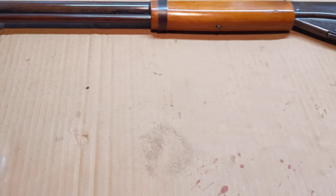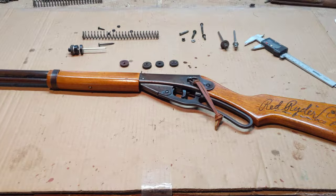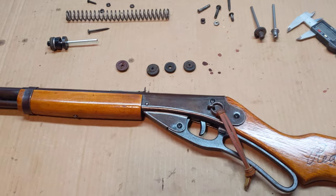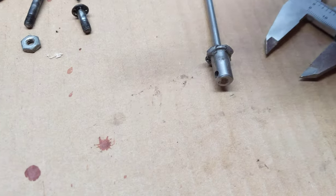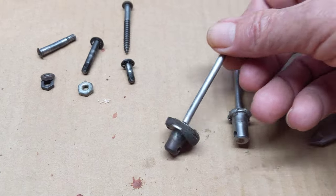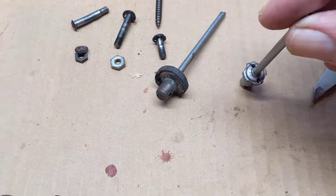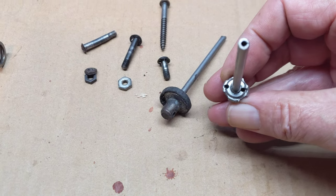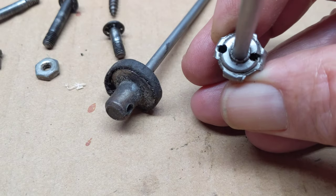The client has actually done quite a bit of work on the gun himself. He replaced the original leather seal set with a replacement seal set in leather with the original top hat. So that means the plunger assembly in the gun right now looks rather like that. And if you want to see a top hat with no clothes on, this is what it looks like without the leather seal in place. It's a small diameter tube with two little holes at the base that allow air to travel up the air tube and fire the BB.